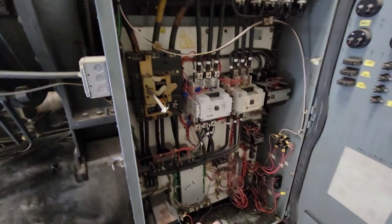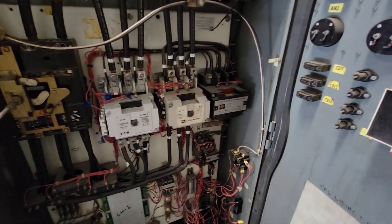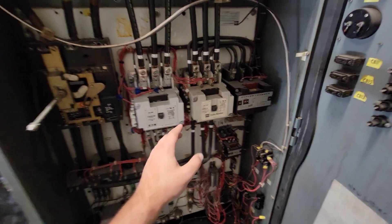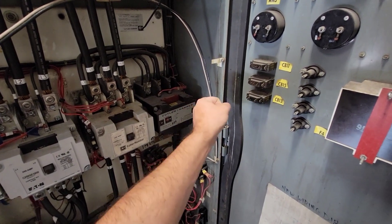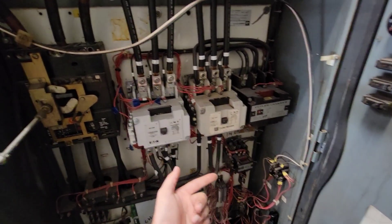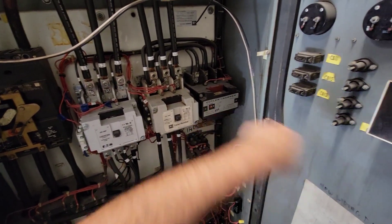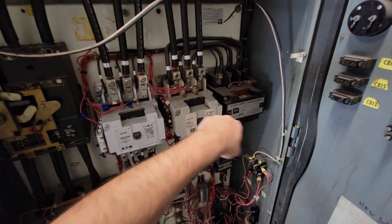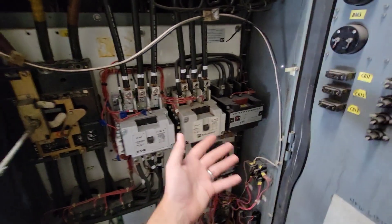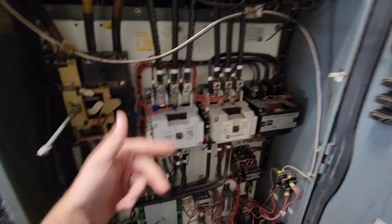While I'm still waiting on Trane, let's do a visual inspection of the starter cabinet on this machine. It has a Y-delta start. What that means is these two are your starters that cycle: this is your primary, this is your delta or run starter, and this is your start starter or your Y. At startup your primary hits and your Y starter hits, putting the windings into a Y configuration just to get some pre-rotation going - it gives a lower starting current. Then once we have it pre-rotating, the starter contact drops and immediately the delta or run contact hits, putting the windings into a delta configuration for run, which is a lot more efficient. We get the lower starting currents because we had it pre-rotating.